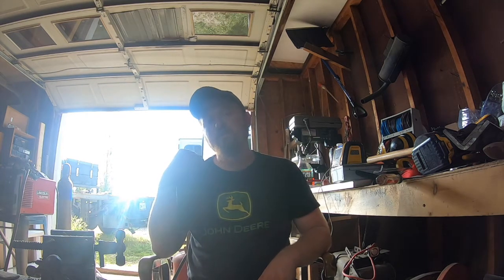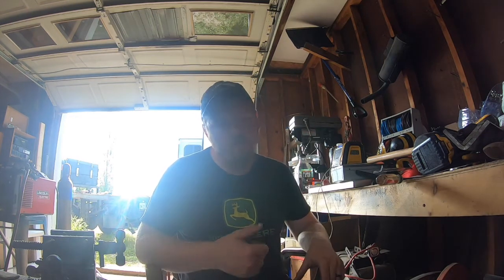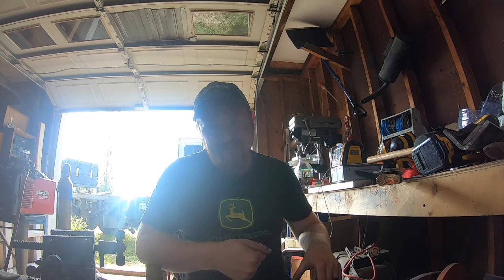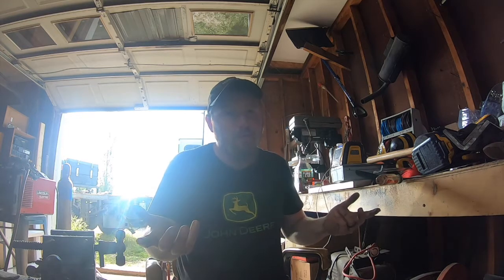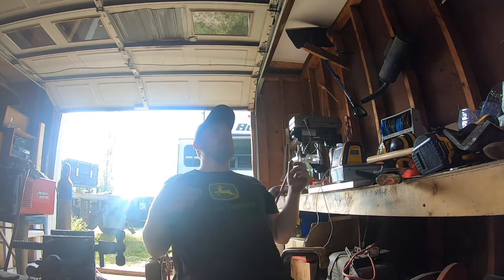This one is actually from my brother's drill press, and it broke on him, and the only thing I had there was flux core. So no cleaning, no preheating or anything. I just clamped it shut and I welded it while it was on the drill press, so there were only maybe two little tack welds I could put on, and it did hold up for about two weeks. It made it through the job we were working on, which was a back blade.